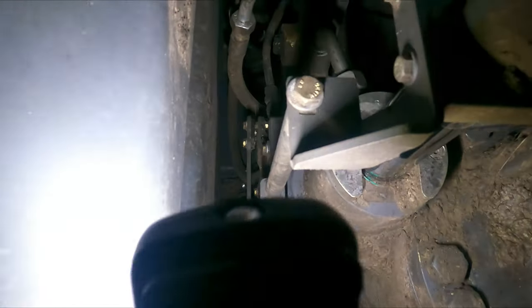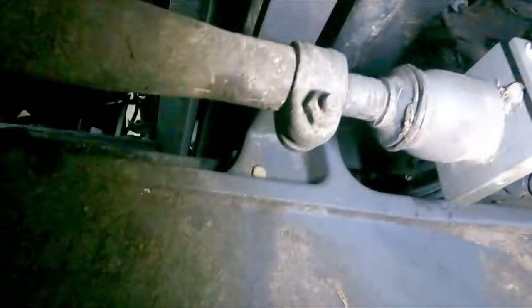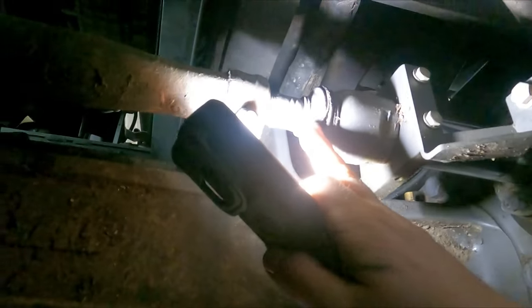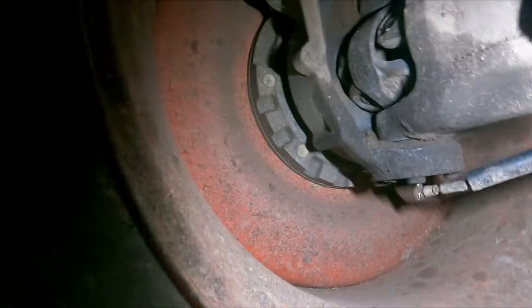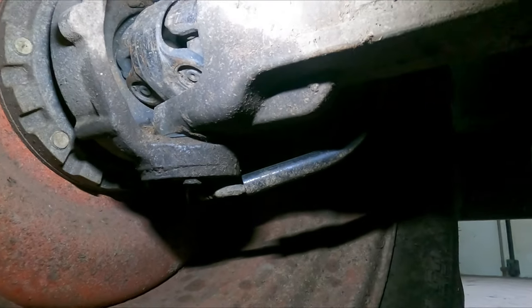So this here, not sure if you can see it, is the steering angle sensor. That's definitely something that you should keep your eye on, because the steering angle sensor hangs down here on the back axle and is susceptible to failing. Steering cylinder, that all looks nice and tidy. Never really had any problems with the steering cylinder. Like I say, here we've got the axial joint that's also ripped open, the boot. And here the same, the grease fittings are all on. We can't see any loose parts, any shavings or wear